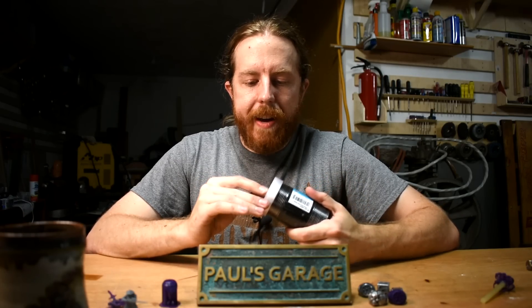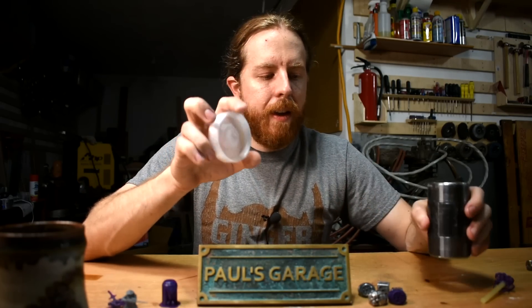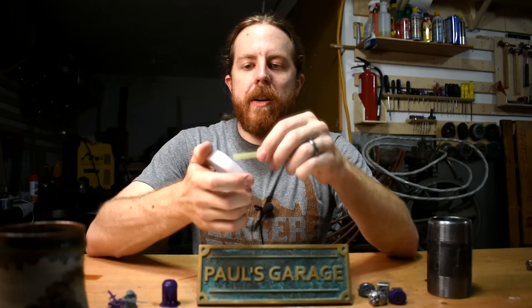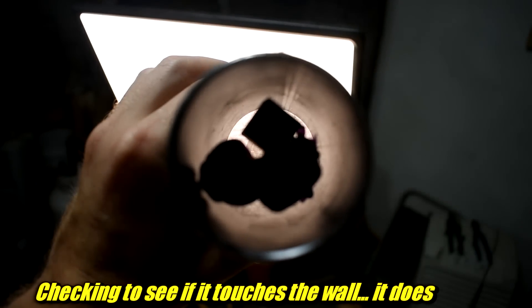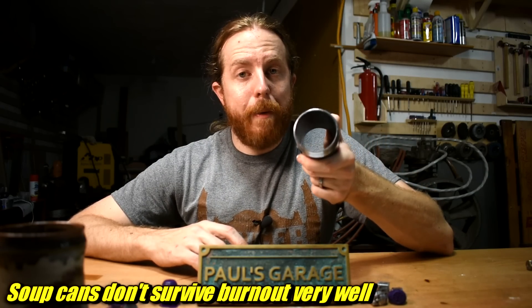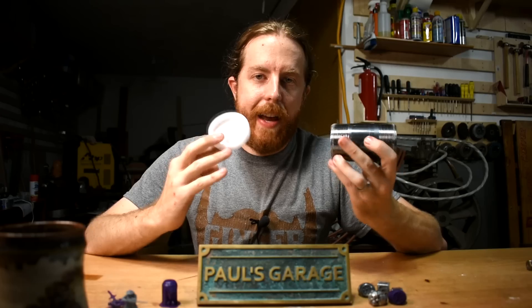If you see professional casting rig setups, they either come with perforated flasks or solid dental flasks, and they generally have a rubber cap with a hole and a little base design so that when you take it off, it leaves a little pouring funnel. You stick the sprue in there and that holds it, then the flask goes over it and you pour the plaster in. I don't have a dental flask, a vacuum casting rig, a perforated flask, or a rubber cap. I have a 2-inch black pipe from the hardware store. This worked much better than I thought - suggested by a viewer. And this is the first time I've ever 3D printed something from a design I did, and it worked perfectly the first time.